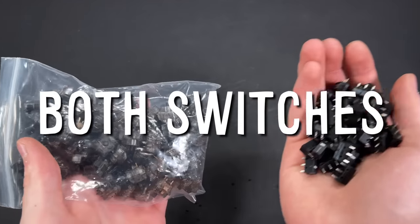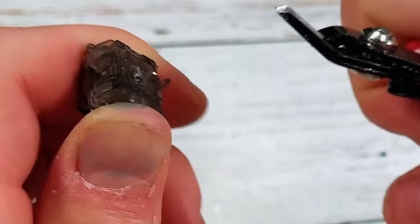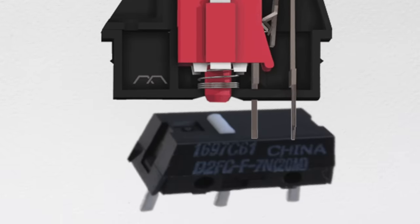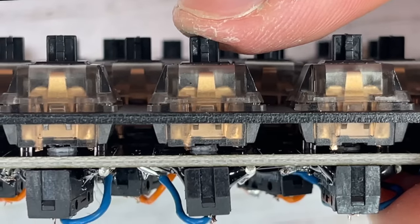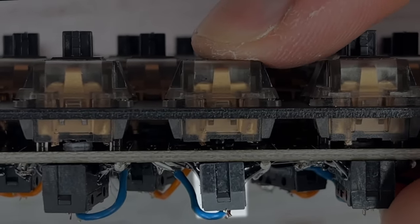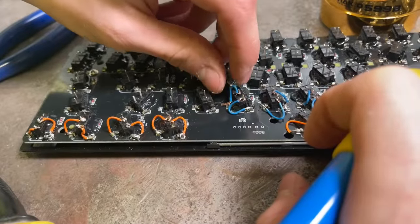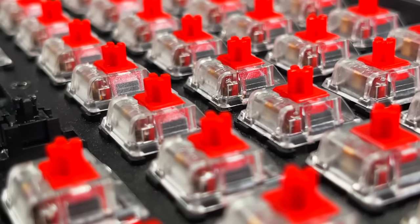Taking all this into mind, here is the 10,000 IQ idea: what if we use both switches? If we remove that protective bump by sliding a mouse switch directly beneath the keyboard switch, we can use the keyboard switch to activate the mouse switch. In essence, the keyboard switch above will stab the mouse switch below, clicking it and allowing you to type. This is, of course, easier said than done.